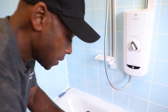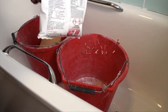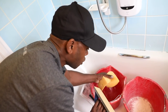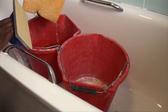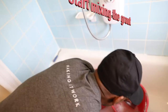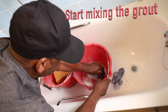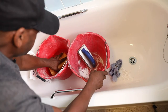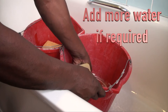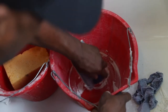Right, so now we're going to pour a bit of grout into a bucket — preferably a dry clean bucket. Then we get our sponge, which we'll use to wipe down the grout once we've grouted it. You only need a little bit of water mixed into the powder — imagine you're mixing flour. You don't want it too doughy but you don't want it too wet. I tend to use a sponge because it's easier to control the amount of water that goes into the grout.